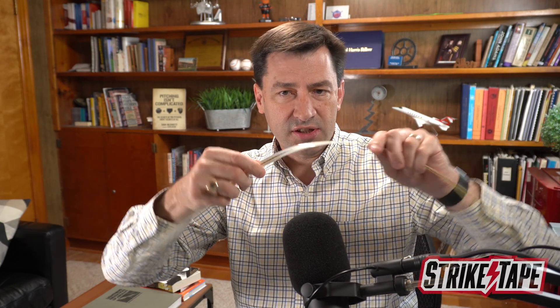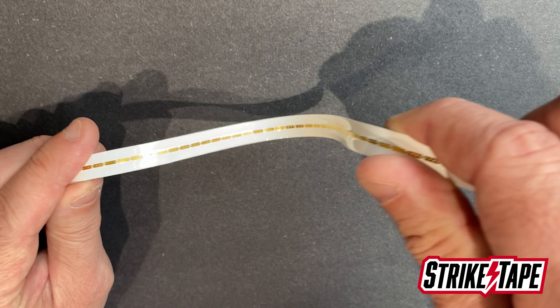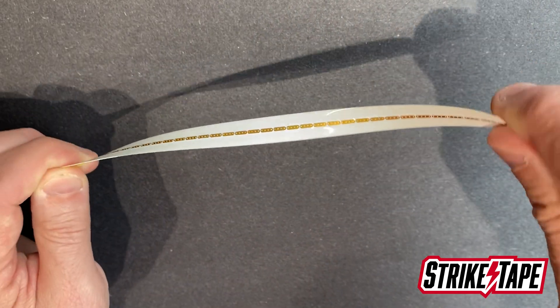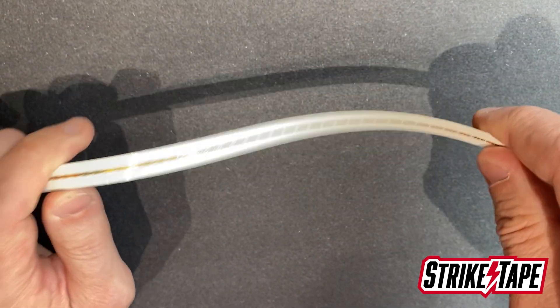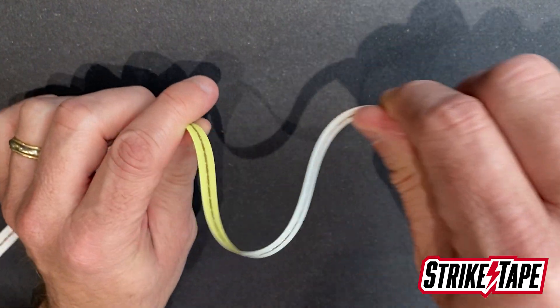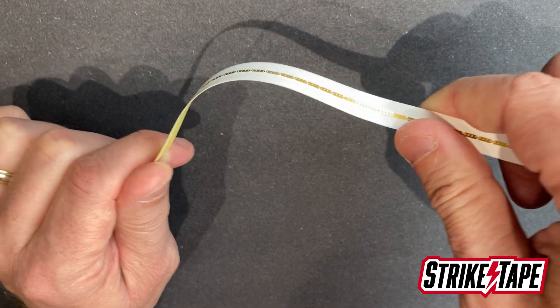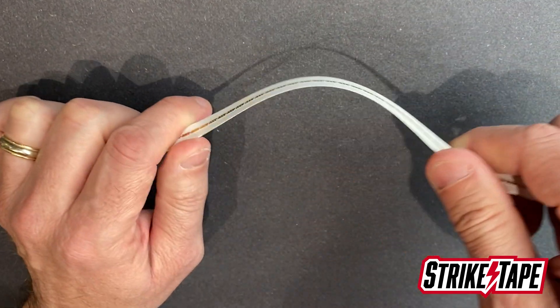As you can see, this is a segmented lightning diverter from WeatherGuard Lightning Tech, which we call StrikeTape. It is extremely flexible and it will contour to almost any radome surface. It is relatively simple to lay this down on the most complex of shapes, so don't worry about having a very uniquely shaped radome or very tight corners. The segmented lightning diverter will fit almost every application.